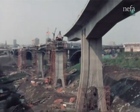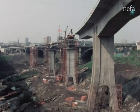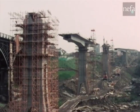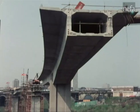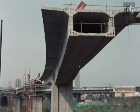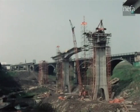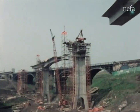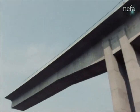Across the valley, four high-level double cantilevers were built to span the gap. Here two are complete and one is about to start. The casting and erection of the individual segments required a sustained effort in high-quality engineering organisation and control. The constantly changing alignments, stresses, deflections and loads were calculated by computer for each step and monitored by the contractor and consulting engineers as work proceeded.